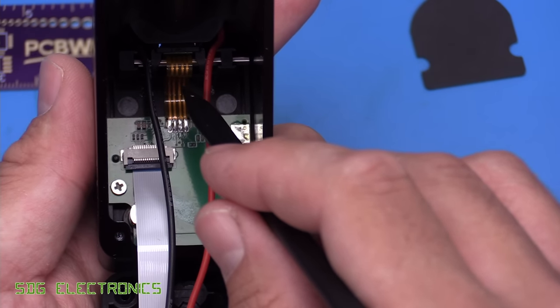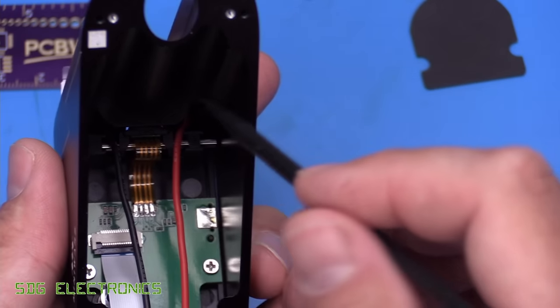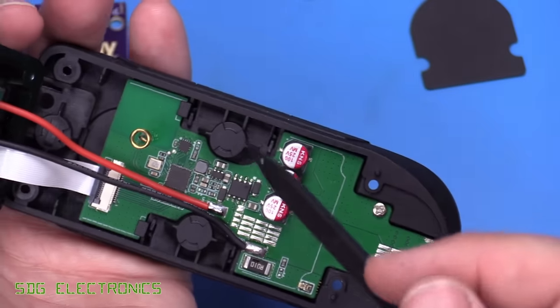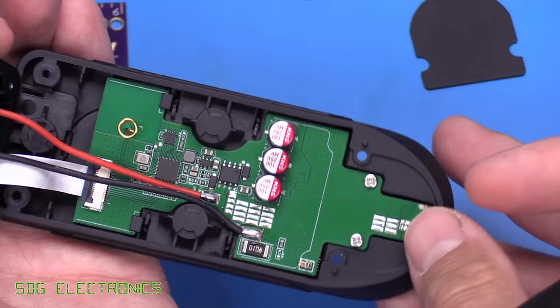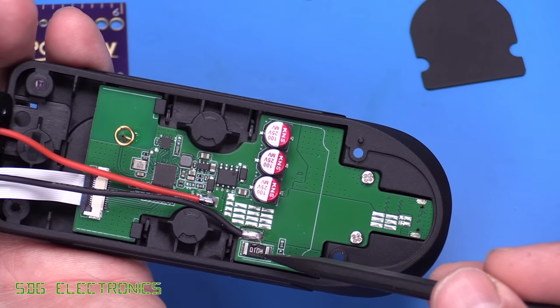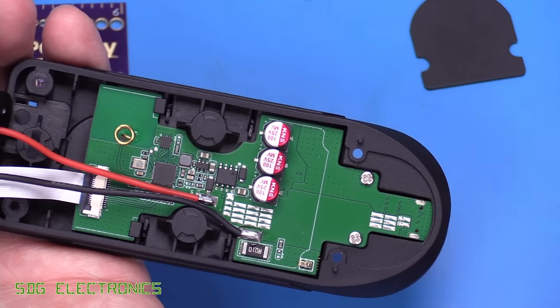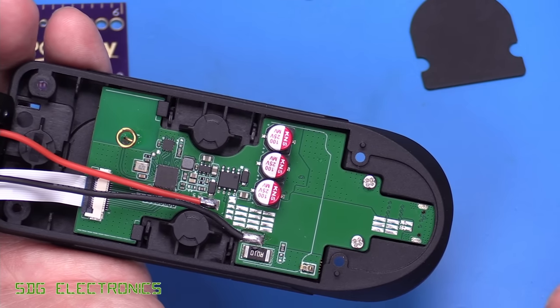You can see it's one of those I2C OLEDs with four wires going off to it. Then we've got a couple of wires going to the cradle — the power to the supercapacitors is being controlled directly by the DC-to-DC converter, and we've got some power monitoring here with a little current sense resistor so the microcontroller can see how much power is being delivered into the supercapacitor.